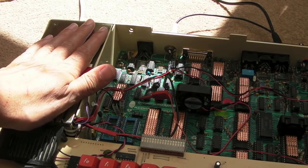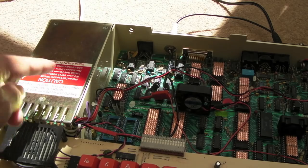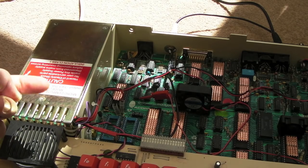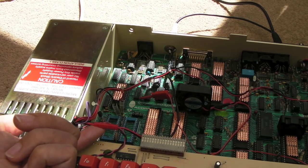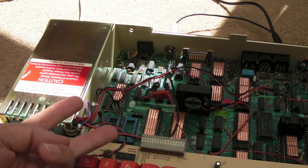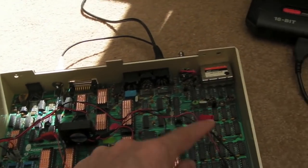I took the power supply to pieces. I followed from the auxiliary connector underneath to see where the 12 volts connects to, and on mine, it goes to the yellow wire on the auxiliary connector. So I've just tapped into that yellow wire there and put this little connector here, as you can see. And you've got male and female connectors there, and I've switched them around so you can't mix them up with any of the other connectors. And actually, the distance wouldn't allow it anyway.